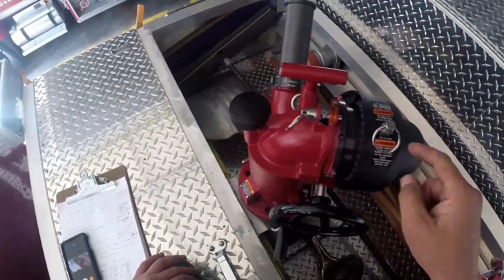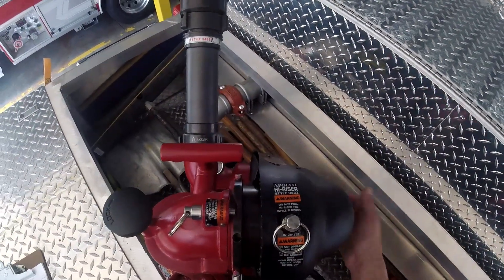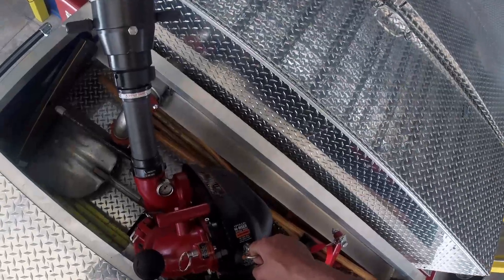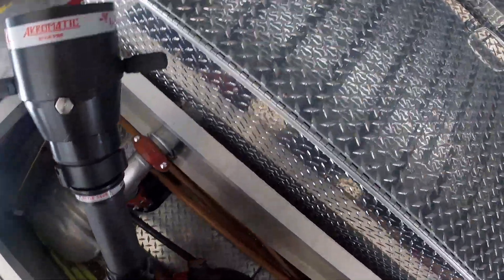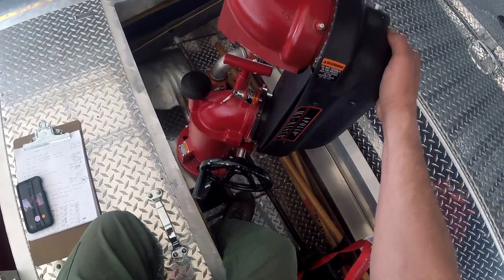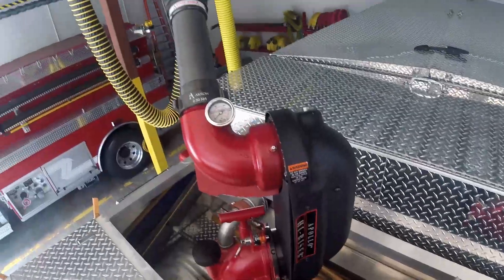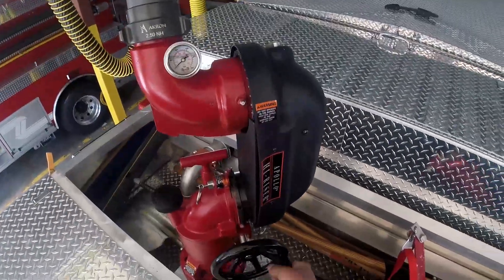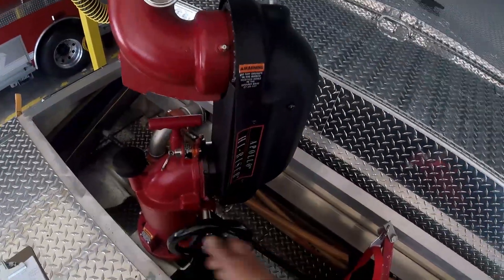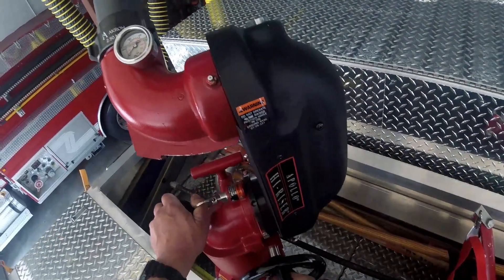So this monitor, you can flow it with it depressed or the elevation down here on the second joint. But it's really designed to rise up. So this pin right here — pull it up and then you lift up and it'll lock into place. You'll hear that lock. And from here, that hand wheel still adjusts the elevation. It'll actually go up past 90 degrees, straight up. As it goes down, it'll hit the 35 degree lock pin. If I want it to press lower than that, I can.